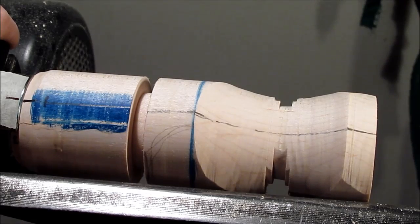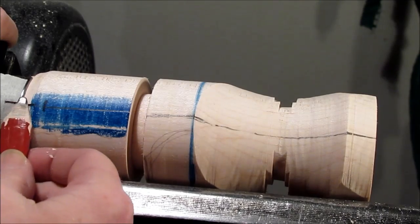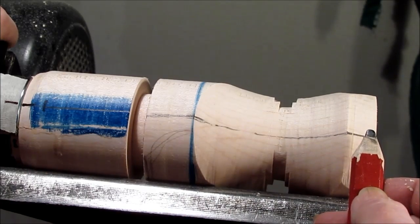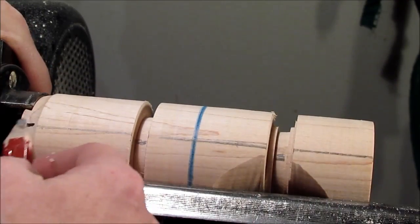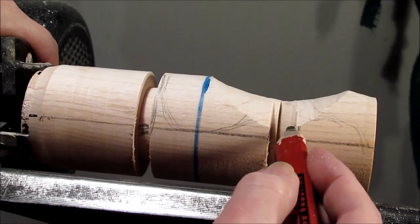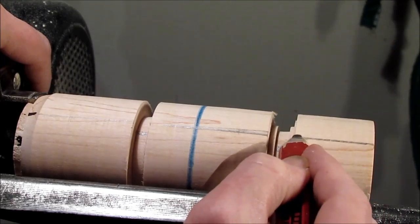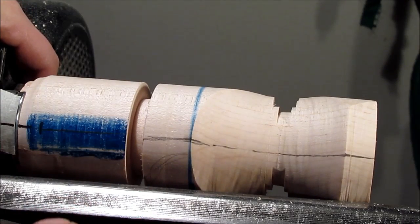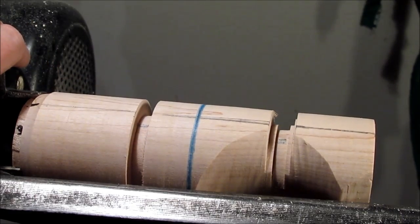Now I want to make sure I'm even all the way along. I've marked a line from the beginning to the end along the shaft of the number one position here. I've marked the same on two and on number three. What I want to do now is make sure my cut comes up to the next line here, and the cut here is up to this line — that way I know my corners are all going to be relatively equal as far as I can figure.